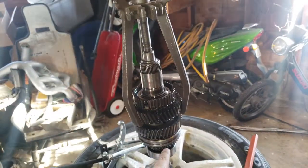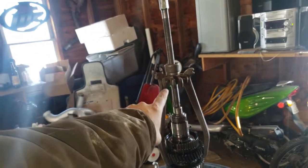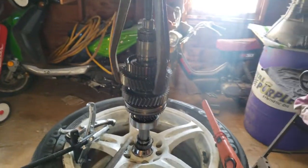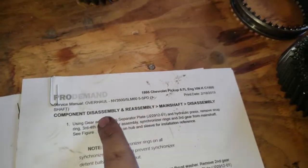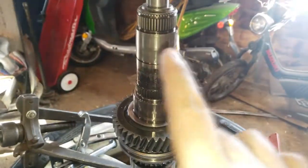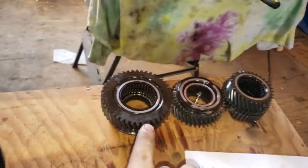Back on the transmission main shaft — my puller wasn't long enough, so Jeff at MNR, the local shop, let me borrow his longer puller. I didn't even need to use the wrench; I just tightened it up by hand and it's pulling that gear off. He also printed me out disassembly and reassembly paperwork. The next gear is off and in line with the reassembly I've got going.